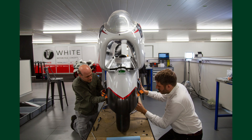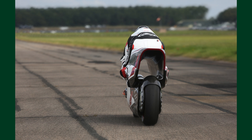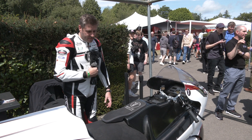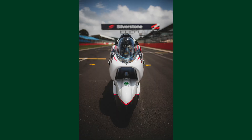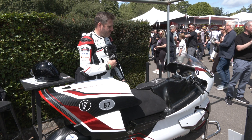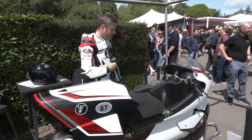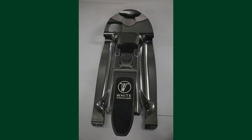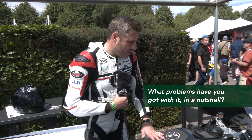The bike's intention is to demonstrate an aerodynamic concept, and the best way to do that is to go as quickly as possible. Drag increases at the square of speed, so the best thing is to go as fast as we can. We're looking for an electric land speed record. With this interim powertrain — about the same horsepower as a 600 — we're breaking 200 miles an hour. We're looking to move the bike from about 100 kilowatts to 350 kilowatts, which will enable much bigger speed numbers. It's difficult to run those speeds in the UK with only 2.2 miles of runway; ideally we'd run over six miles — probably the States or Bolivia would be the place to stretch the legs on this bike.